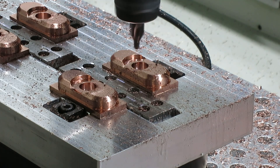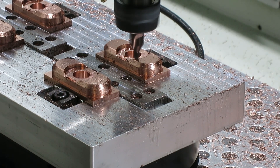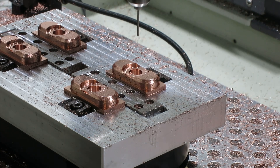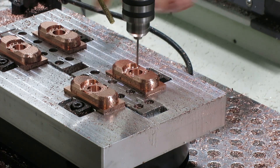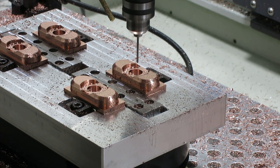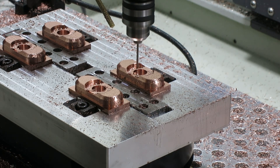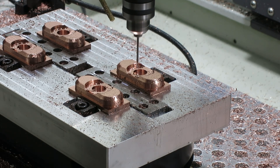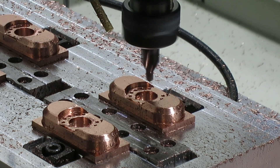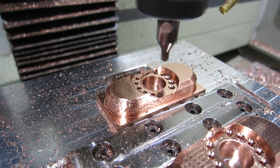This operation here I am spot drilling the balance holes. That happens 10 times on each spinner. This hole doesn't go all the way through the stock — it just goes all the way through the body of the spinner, so when we flip this over you're not going to see the holes until we cut in the button pockets. Now I'm chamfering all of the balance holes to make them look nice — and that is done 40 times across 4 spinners.